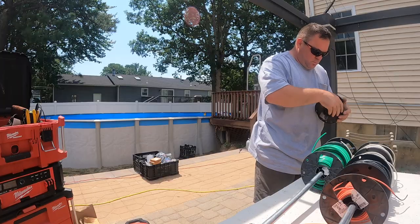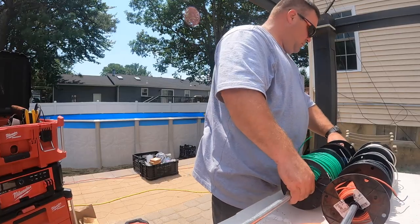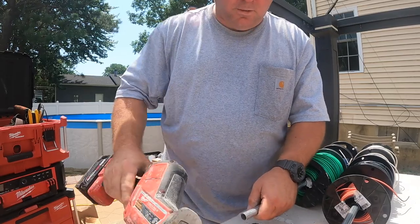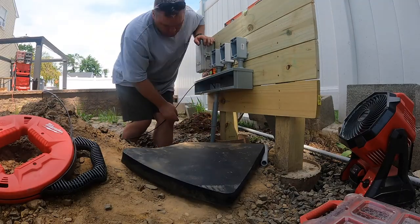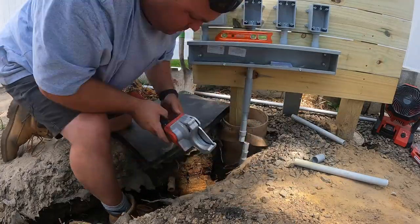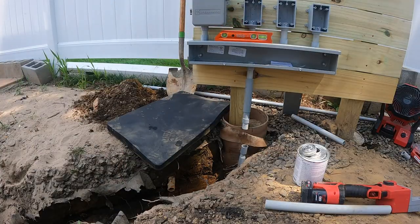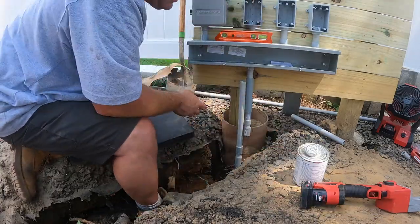This is probably my favorite part of the job because I'm just standing up — not digging or working with the equipotential bonding grid. I'm cutting using half-inch EMT for the reels, setting them up on my reel rack tool to run the THHN. That's the Milwaukee nylon snake, which is perfect for pulling wire — easy on the hands too, unlike a steel snake. I had some kind of problem here with the depth or length — something wasn't right, so I had to fix it.